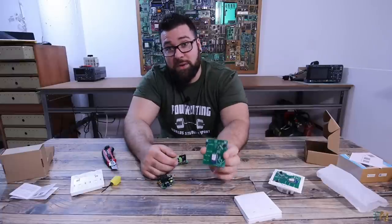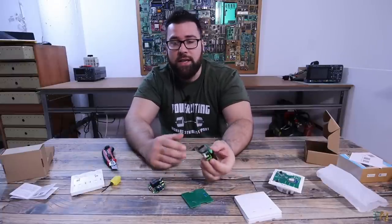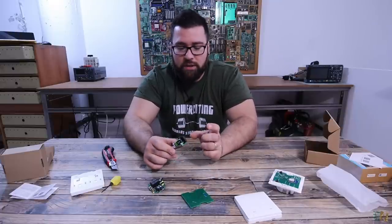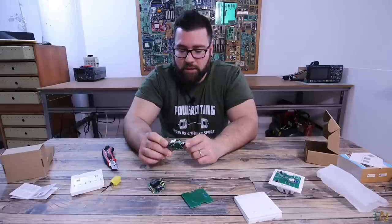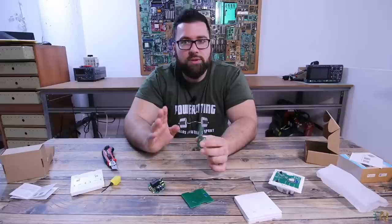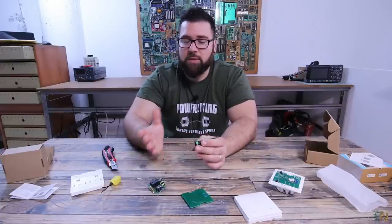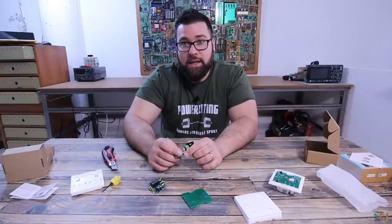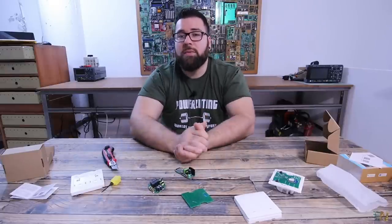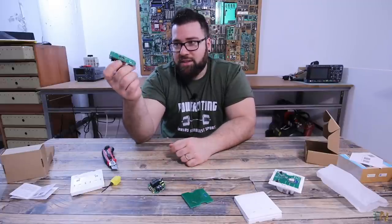Okay guys, so I think that this should be another interesting project, because based on this design, I'll change my Nubix board to be able to receive signals from Alexa and then control the light with an SSR, a solid state relay. And also I'll change this PCB to be a lot more safe, to have a fuse input, and also the tracks will be a lot thicker, separated, to have a lot of clearance between the low voltage and high voltage, and so on. So stay tuned for that, because I will change the Nubix board and make the lights of my workshop be controlled with Alexa, which I guess is very interesting, because this board should cost you just a few dollars.